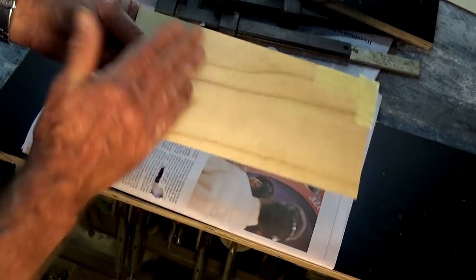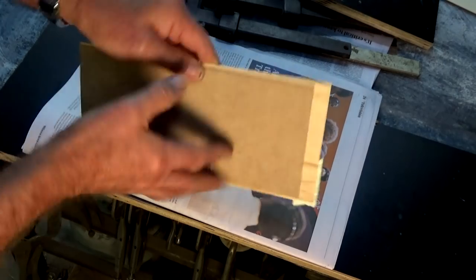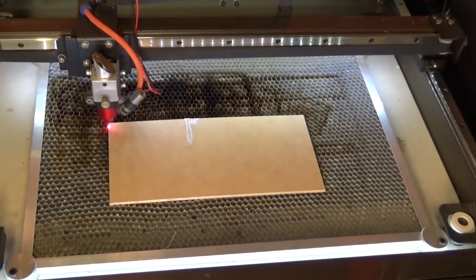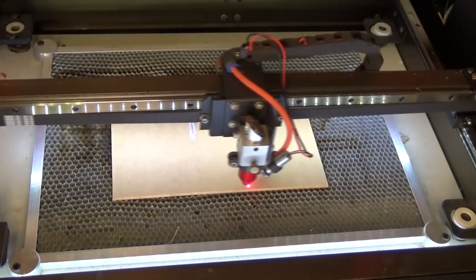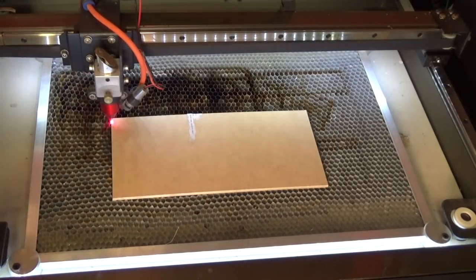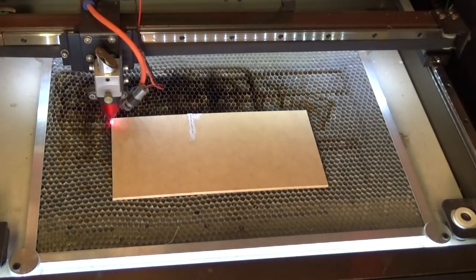That's kind of nice and flat — no bubbles, no loose edges anywhere. We're going to trim the back of this now, then laser cut right through. Remember, this is the back side of the display panel — this will be the front. Once we've lasered through that, we'll glue our other sheet of veneer on the front. I'll run the laser to check it's going to fit on the stock — it's a bit tight, but I've checked it at both corners, firing the laser at the top left and top right. It's on the material, so I'm happy with that. Let's go ahead and cut it out.